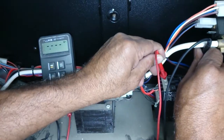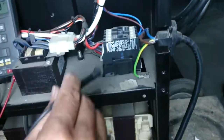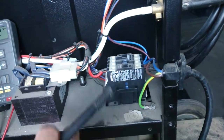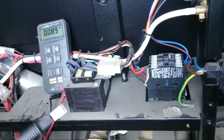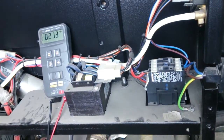So all the terminals in between — no leak. The reason we check the terminals in between is that if there is any arc out in between the contactors, or there is a loose connection, we will get some voltage there. So we can judge how good the contactor is — good or bad — or if there is a burnt contactor or whatever.